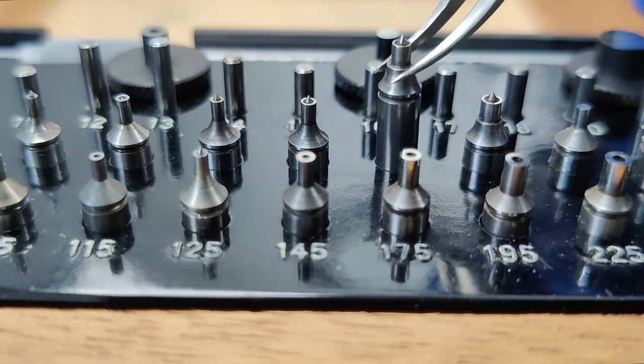Now the regulating arm was originally positioned here. Now this arm is used to make fine adjustments to the rate at which the watch runs, in other words, either speeding up or slowing down a watch. So when it's swung to one extreme like this, it usually means there's an underlying issue. Initial timegrapher readings looked okay, but when you look closer, you'll see I had to move the regulating arm to one extreme because it was running too slowly.